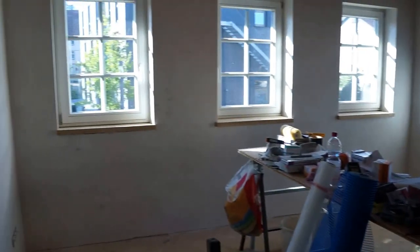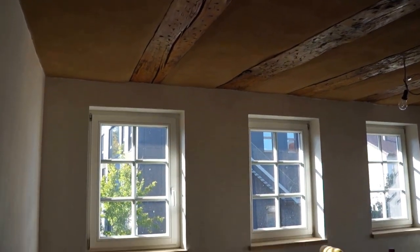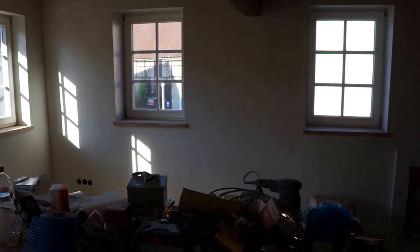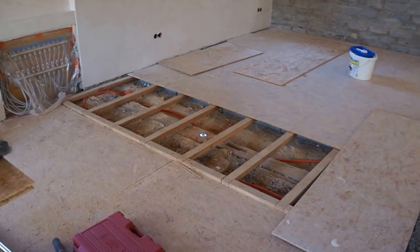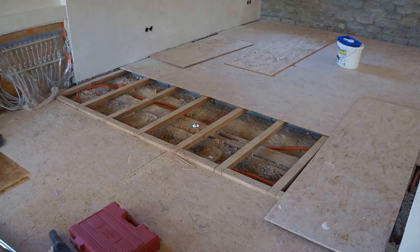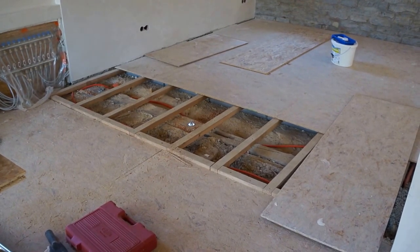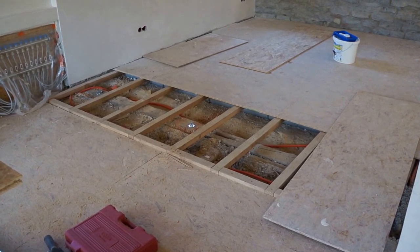In the living room, same deal — walls are all done and ready for painting. The silicate-based primer has been done on all the clay ceilings, so it's just the painting left. The windowsills I'm really quite happy with — something I made myself, and they make the room feel kind of finished. Except for the big hole: I took up the temporary flooring and you can see some shiny bolts — that beam was broken and I'd put off dealing with it for a long time.